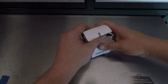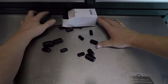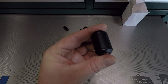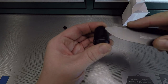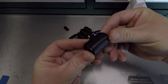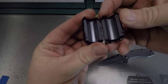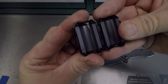These are ferrite clips, or ferrite cores, or ferrite chokes — they go by a couple different names. Basically what they are is a filter against electronic interference. You commonly see these wrapped around the cords of chargers for laptops and stuff like that. Inside you can see there's a ferrite ceramic core that wraps around the wire.